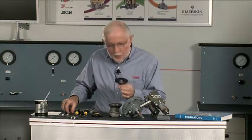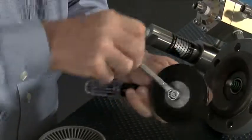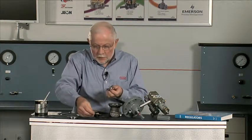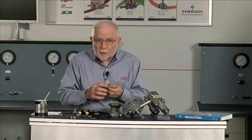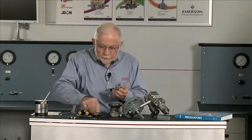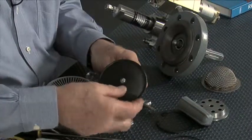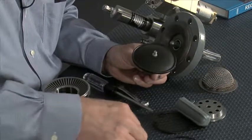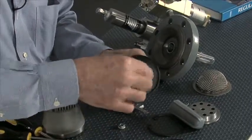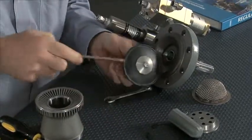If we determine that we need a new diaphragm, there's a little place in the back to put a screwdriver through. We take this nut off, and we're going to be able to pull this diaphragm off the head. There are a couple of O-rings in here that give us the seal on the diaphragm so we don't over-squeeze it. We put a new diaphragm in, put some new O-rings in with a little bit of grease on them, slide that down, add grease to the top O-ring as well, then the valve plug, then our nut. We draw that back down — this is a machine tolerance that goes metal to metal so we can't over-squeeze the elastomeric part.